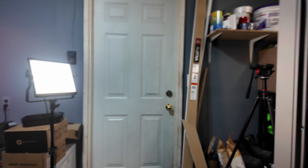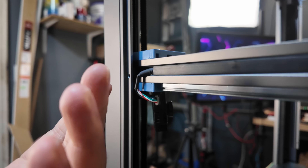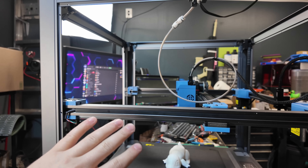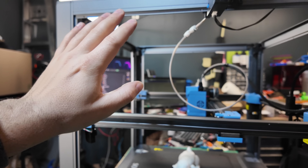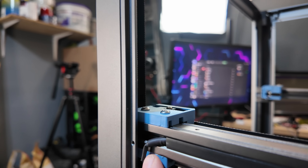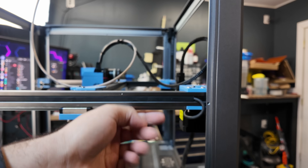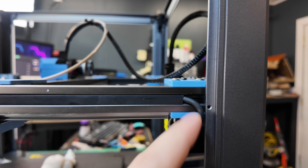The camera on the stream couldn't get working — I switched USB ports and now it's working. But as you can see, there should be a panel on here. Shipping a Voron clone without panels and without even an ABS profile is sacrilege. These wires here are going to rub on your panels — both of them will probably end up rubbing on the panel and leaving streaks up and down because this moves up and down every print.